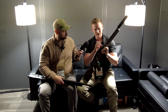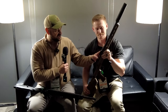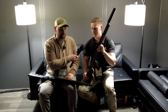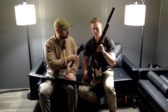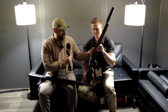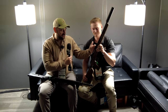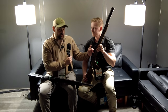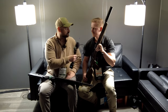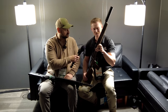It's going to have an integrated Picatinny rail and recoil lug — everything's on the receiver right there. It'll be just like a standard Remington 700 style recoil lug, just machined into the receiver. I really like that because I don't like the Remington system where it's sandwiched between the barrel and the receiver. I think it's a better foundation for repeatable accuracy to be machined one piece with the receiver. Absolutely — you have less mating surfaces and less opportunity for wobble between your barrel and receiver.